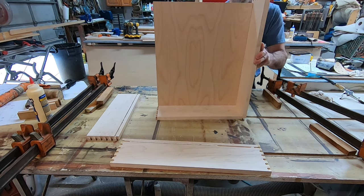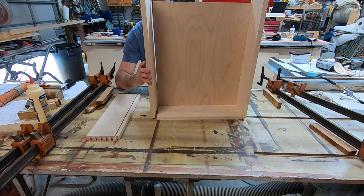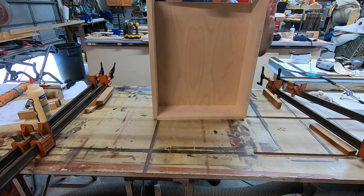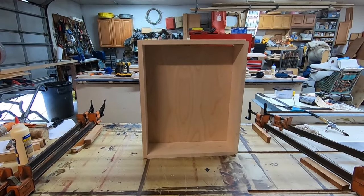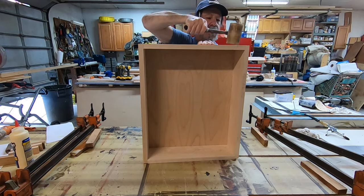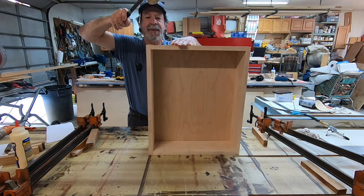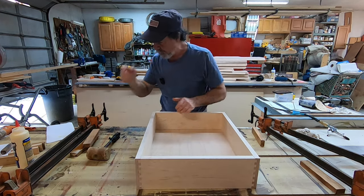Come on — it's about getting your parts lined up. You don't want it to tip over because it's a little bit of a catastrophe when everything has glue or phenoseal on it. We're hoping we're still in frame here. As soon as you stand the drawer up it's out of frame. Okay, so what we're going to do now is tap it in — this is where you find out if you put too much glue inside the sockets, if it doesn't want to go in.